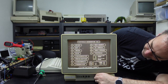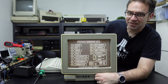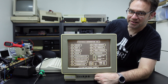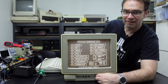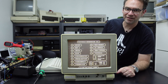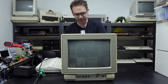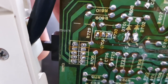Remember what I was saying about bad solder joints? I think I just found it. And that's possibly why the seller thought it was only in black and white — because the switch is busted and it may have been stuck in monochrome. That's kind of funny. I'll pull the board out and re-solder this switch. So it is a repair video — yay! Yes, there are some bad solder joints on that switch — almost all of them are broken. Nasty.